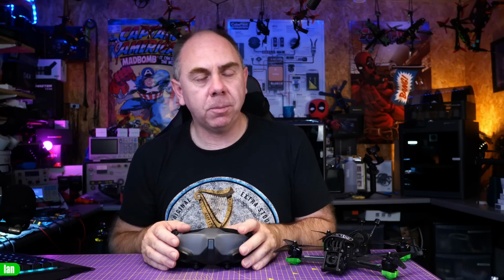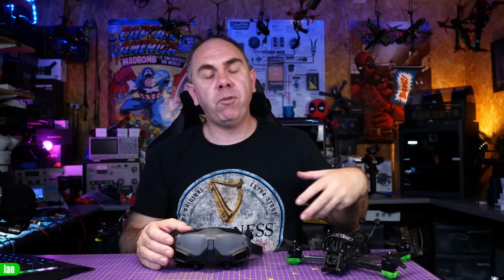And what I would say is I wouldn't rush out and spend huge amounts of money on new antennas for your goggles just to put left or right hand circular polarized on your quad. Everything is a balance, because you've got to remember your quad may be fitted with a dual band antenna now, which is linear, but that antenna is not as efficient as, say, a left hand circular polarized antenna specifically designed for 5 gigs. And whilst you may be introducing a mismatch of 3 dB, you still could gain performance as a result of the new antenna on the quad performing much better than that former dual band one.